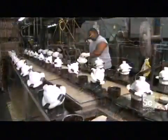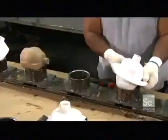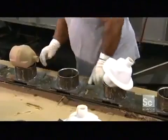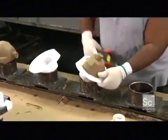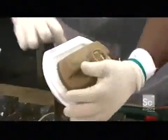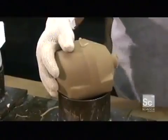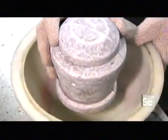In just two minutes it's ready to extract. This core is oblong, flat on one side with a knob. There are different versions of this core design, each one carefully calculated to manipulate the bowling ball's performance at a specific skill level. They then drill toward the center of the core to make a pinhole, which allows the core to be suspended in just the right position in a second mold.